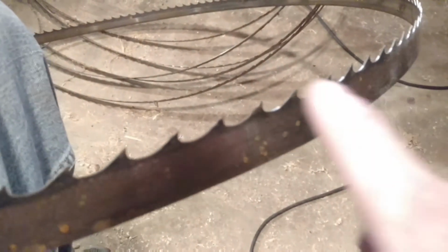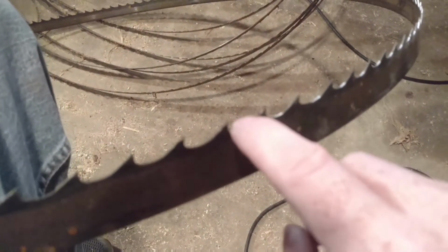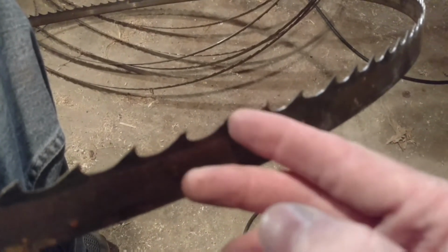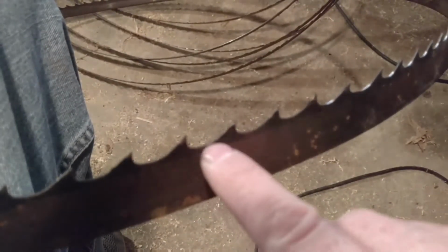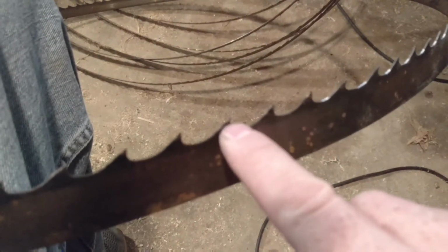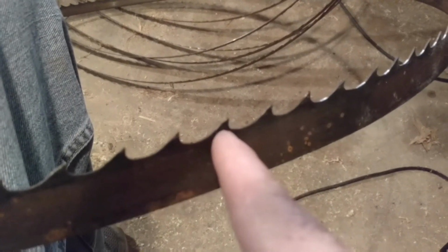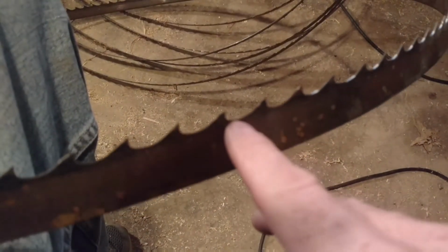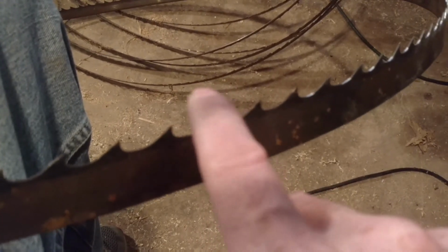And all I'm doing is more or less taking the debris out of there, and just giving it a shine in there. Now, the reason I come down through here, most of the tools they make for sharpening these saw blades have a blade on them, and all it does is come down and sharpen this edge, move over, sharpen this edge, move over, sharpen this edge, and that's fine. All you're looking to do is put a point on this. You're trying to keep that sawtooth at a nice sharp point. You're putting it at like a 90-degree. All you're doing is going straight across, so there's no angle on the cut. It's just a square, nice point to the tooth. And that's what digs into the wood and takes that piece of wood out of there. When these teeth start getting rounded over and they don't have any bite to them, that's when you start dulling your blade out.